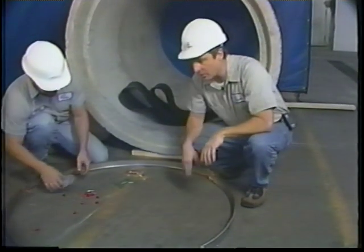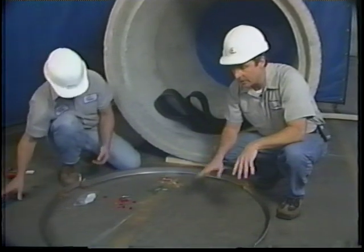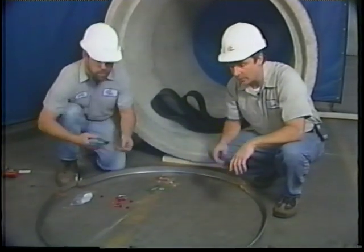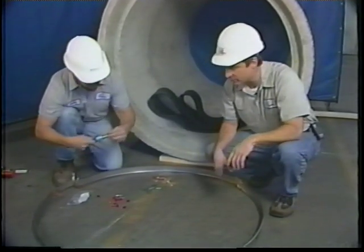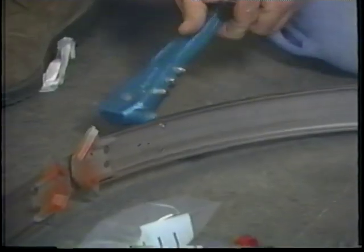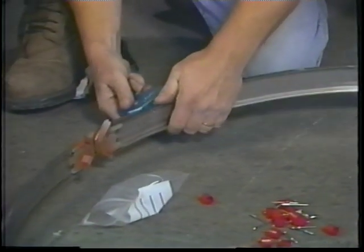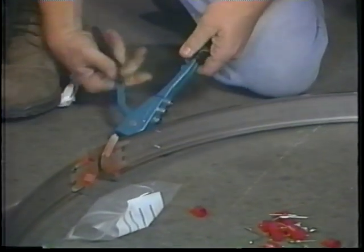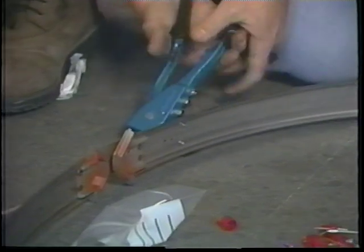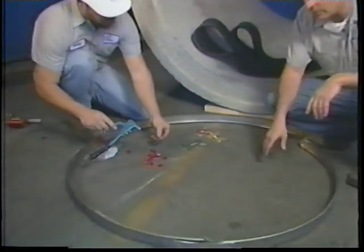The rivets are only to hold the structure in place while you're doing the assembly. Once it is assembled and you begin to torque it into place, the rivets will break and free the seal to move. With a seal this diameter, 2 people are required. The smaller ones can be done by one person, but as you'll see further on in the video, just holding it in place really does require 2 people in this diameter.